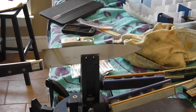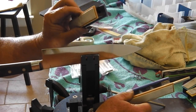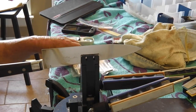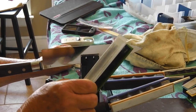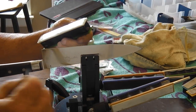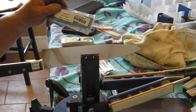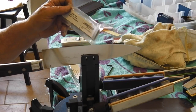We finished all the sharpening. Now we're using the ceramic paddles. We start off with the medium, the brown, then go to the other side which is white — really fine. Then we use polishing tapes on the back side of the DMT diamonds as a glass plate. They're adhesive and stick to the glass plate. I have 2000, 3000, and 6000 grit tapes.